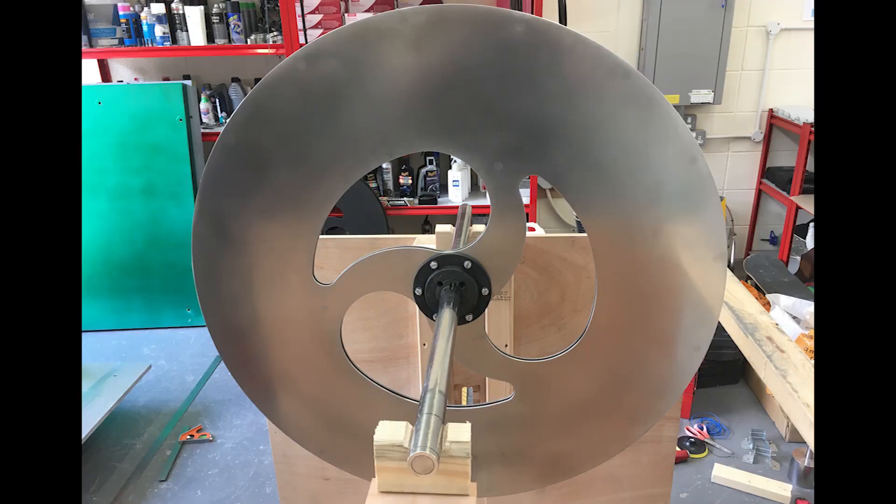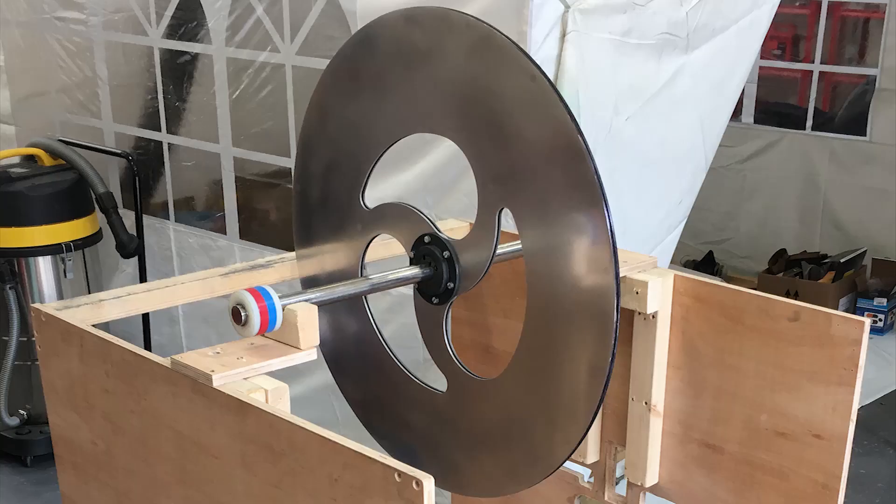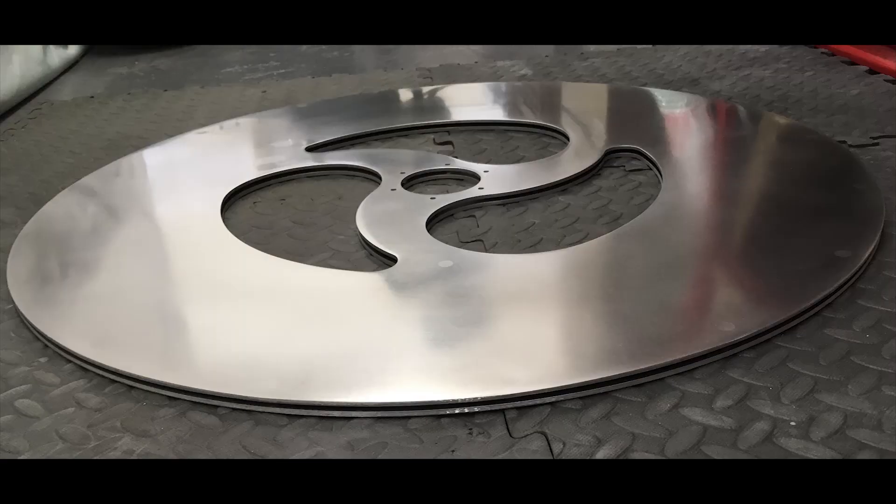When we were using three magnets on each end of the shaft instead of one, the bearing was much, much stiffer. And it's now oversensitive — so that's a good thing in one respect and not in another. Because at the moment, if I put a piece of blue tack on the periphery that weighs micrograms, that will create a static imbalance. So I'm going to have to tighten the bearings up a little bit.